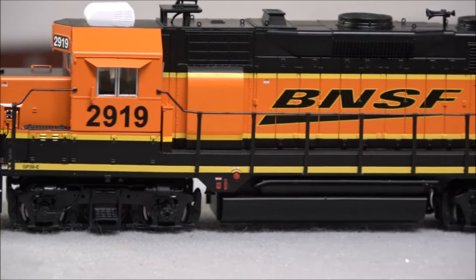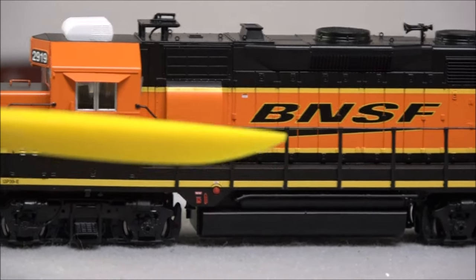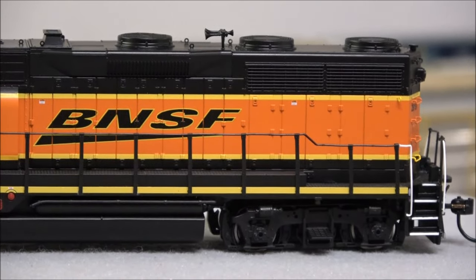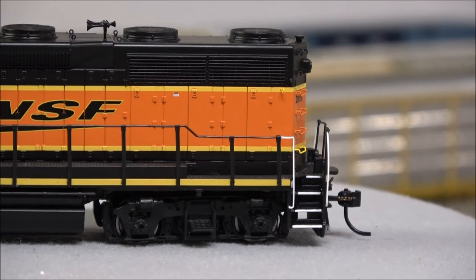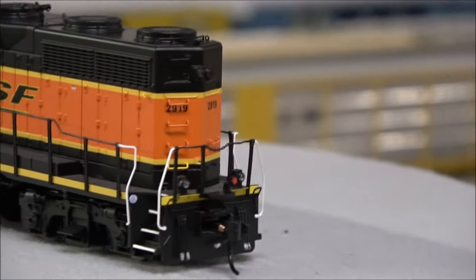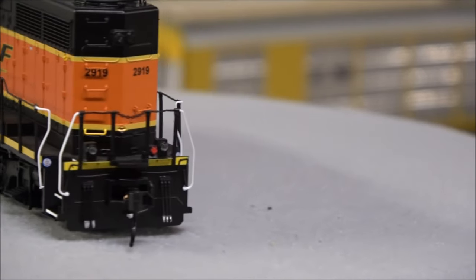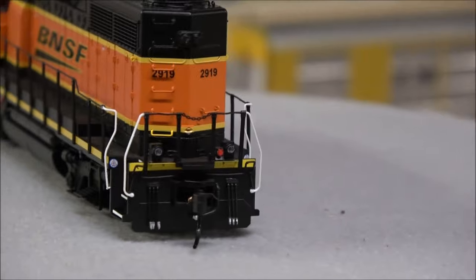As you look on the side, truck and fuel tank detail, including emergency shutoff, blower housing, pronounced on the side, BNSF, the swoosh logo, as I mentioned, separate compartment detail, lift rings on this locomotive as well, and on the rear, more of the same. Now, each stair has a white paint on each sill to help the crew see in low visibility situations where the stair is. And then you've got rear ditch lights as well, a rear MU receptacle, accessory hoses, airline hoses, again with silver tipped ends.